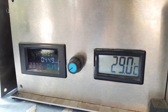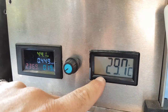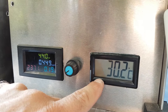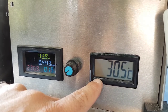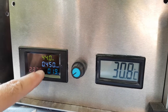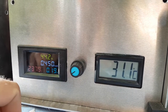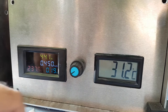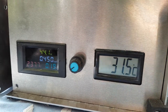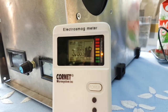You can see the controls. This is the temperature of the magnetron — it has not exceeded 150°C. And the other is a power meter for the mains supply, so you can see the heat transfer. You can see the fans and the heater transformers — 44 watts currently, but at full power it's 1.5kW.